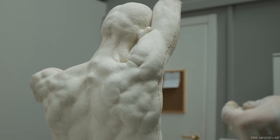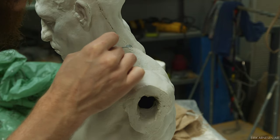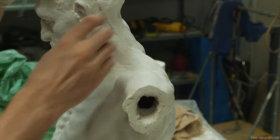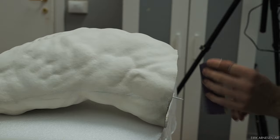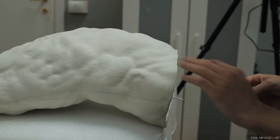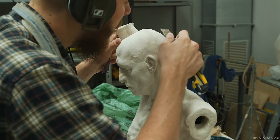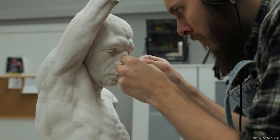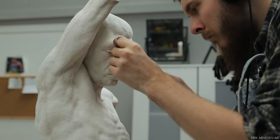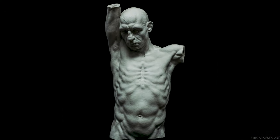As I already mentioned, there are always seams to fix — at least when I make molds. The seam this time is fairly simple to fix: there is just a bit of a gap in some places, which can easily be filled. Fixing seams becomes very hard when the two halves are offset, creating a step between the front and the back. As long as you can avoid this by following the way I've described in this video, you should be fine. A little seam work is good for the soul anyways. With all the work out of the way, this piece is ready for its new home in Amsterdam.